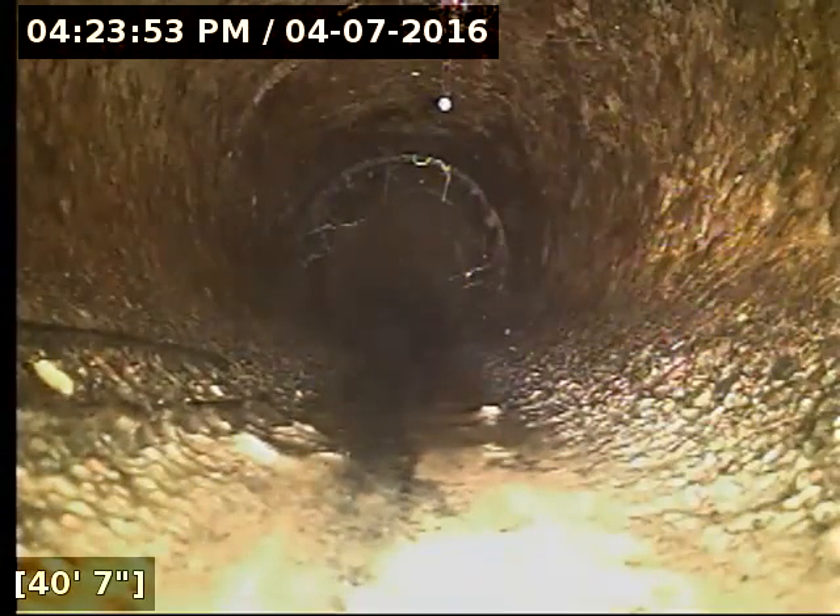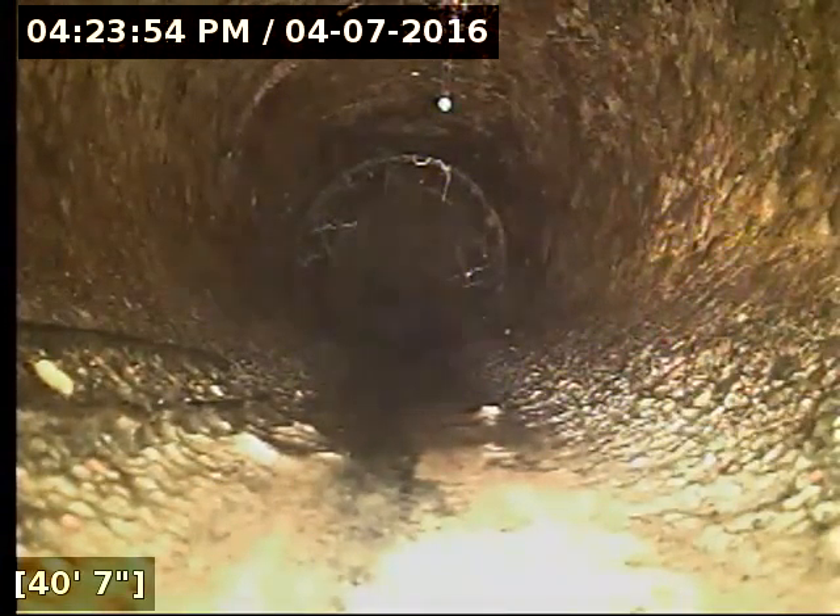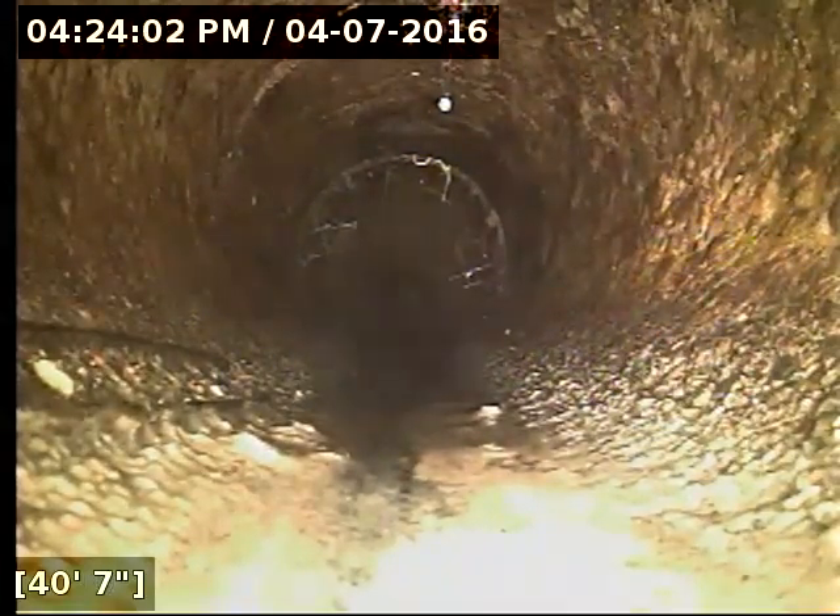We're halfway through the yard here at three feet deep — did a white line showing the direction the pipe is running. Going to reel back to one more marking at the transition from cast iron to concrete. It looks like we've got root intrusion from pretty much every single joint, and you can see there is some standing water on the line. So that's why the excavation technique would probably be ideal, as it would take care of all that.